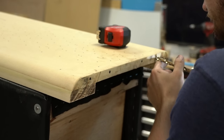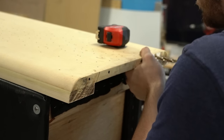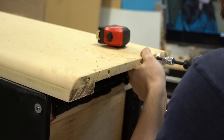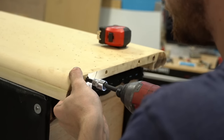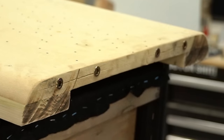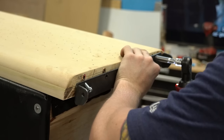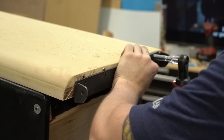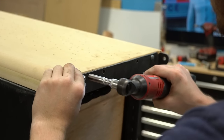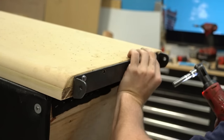This is important to me, I wanna show this here. I'm drilling into the MDF so I can insert my threaded wood nuts, because you know, I wanna make sure everything's serviceable. But in this process, you can clearly see the MDF starting to split against the rivnuts because I didn't drill a big enough hole. And in between the fibers, the MDF is weak. This later does cause it to break, but what I ended up doing was just filling all the cracks and holes with epoxy, coating the whole thing so it was nice and firm and had a lot to grip onto, so it's much stronger now, it's fixed.